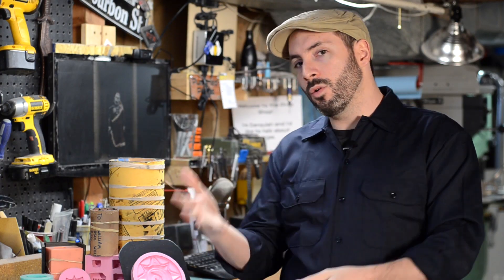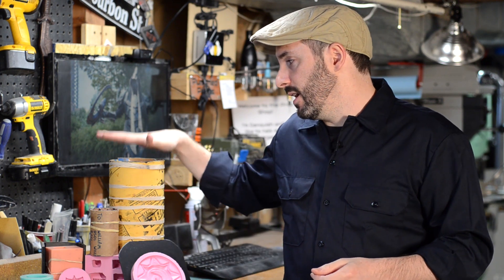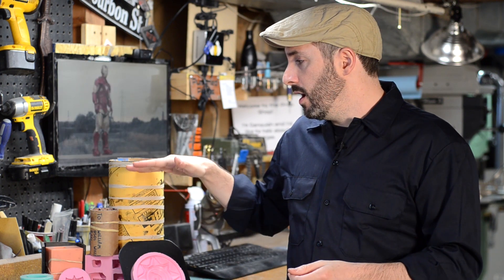Then it's time to mix up your silicone and throw it in the mold. For simple molds, I like using tin cure silicones — Mold Max 30 is pretty good, or TAPS RTV is also a good one. You'll also have to figure out the volume of silicone needed. For something like a tube, I can figure out the volume of the tube, get a rough estimate of the volume of the piece inside, then subtract that to figure out how much silicone I need.